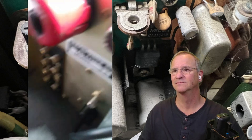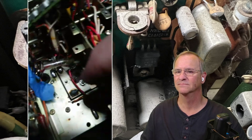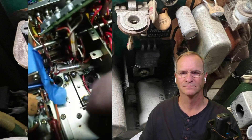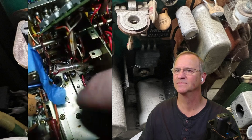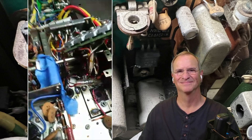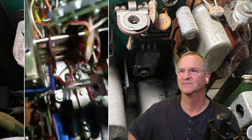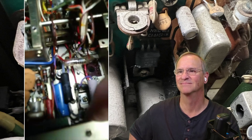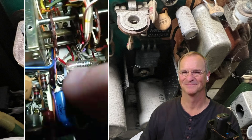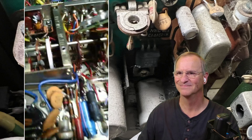So here is your radio, your serial number, and I'm doing the coupling drive area. I've already removed the components in this area, even the one that's buried in between the band switch. I'm going to rebuild this area — you'll see some new terminal strip, some capacitors, resistors, and one buried in between there going down to the ground. That's the coupling drive area. Now the after: there is the coupling drive area — capacitors, resistors, terminal strip. Looks good to me. The one with the purple wire that's buried in between there — all this checks out. Now I'm getting ready to put it back together.